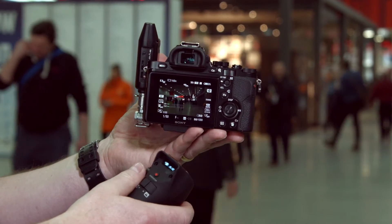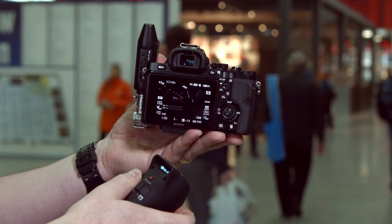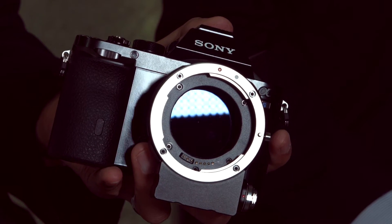In very basic form, what is this? This is a lens adapter which goes from EF mount lenses to E-series Sony mount. It's going to have various things incorporated into it. It can be used as a manual device, controlling the electronic neutral density manually. This mount has the LC Tech technology inside, and it will allow us through the application of a voltage to the liquid crystals to change the level of ND on a variable basis — going from 3 to 8 or 10 stops on an electronic basis.